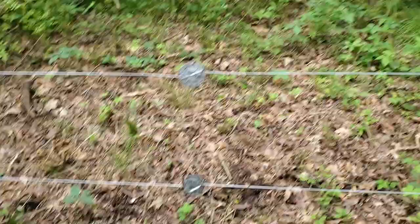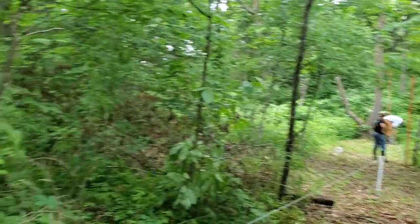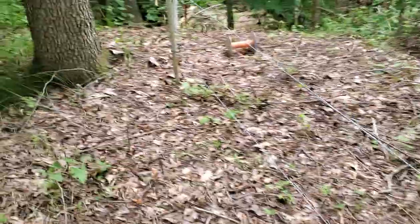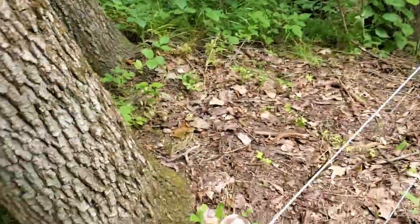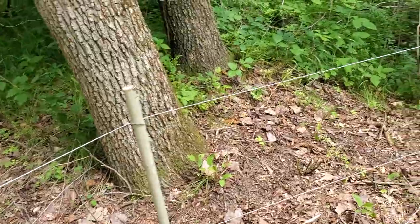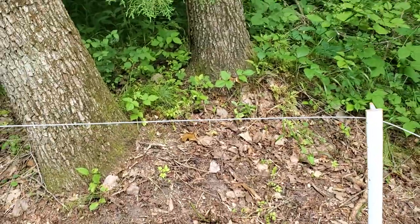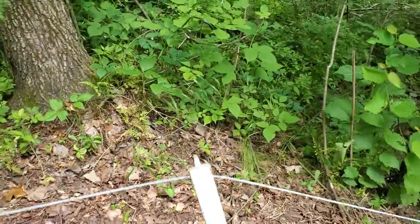There are our daisy tensioners. We actually pulled from that corner and we're coming down here to the creek. We drop over this bank — it's steep, eight or nine feet down. We drove another fiberglass rod there. If you don't have fiberglass, use a wood post or steel — but if you use steel, make sure you use a good insulator because that's a ground rod.